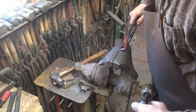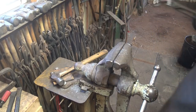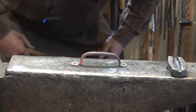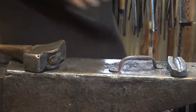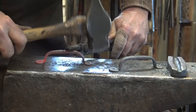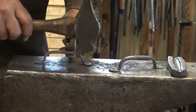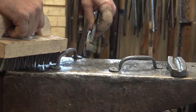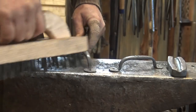It pays to look at this straight down and make sure they're not twisted — you want the finials in line with each other. The final forging step is just to put them on the anvil and make sure everything looks flat and straight and that these are going to sit on somebody's kitchen cabinets just right. I'm pretty happy with those. Doesn't hurt to give them a quick wire brushing, and then before they cool I'll put some paste wax on them.